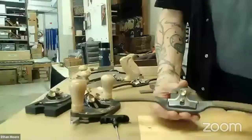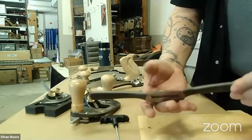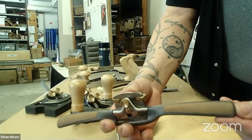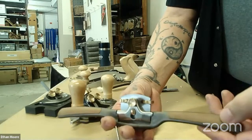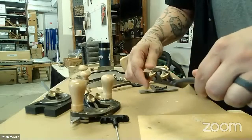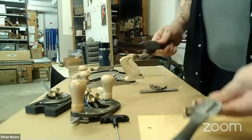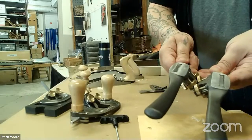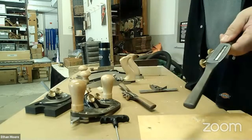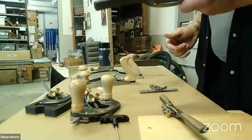These ones are a bit different in that they typically would have a wooden handle — these are all cast. What they've done is they've inlaid the handles with a bit of cork. The first time I thought of that I was like, 'That's a little cheesy,' but it's actually quite nice because you can actually feel the grip — it's quite comfortable to hold on to. One of them is flat and the other has a little bit of a curve on it. The flat one is designed for doing convex work, and the round one is for concave work — inside curves versus outside curves.